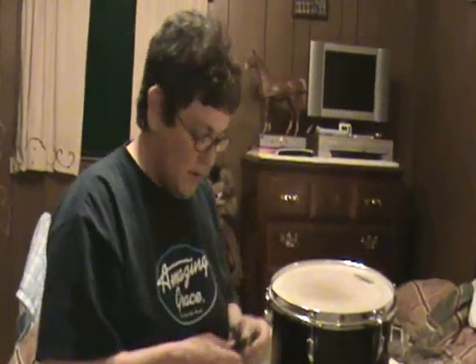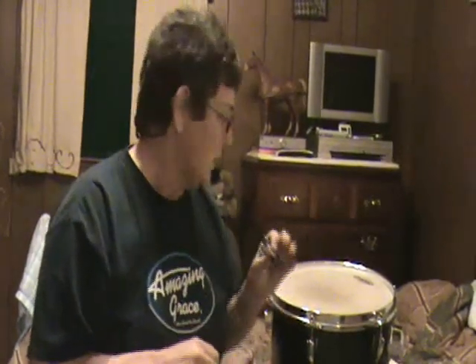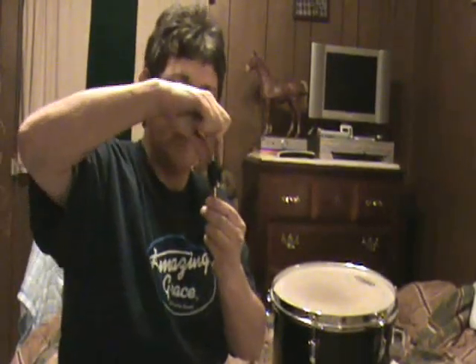The goal is — on this gauge, it's right about six with the resistance — and we're going to start with a half a turn. If you're not sure what a half a turn is, use this gauge as a reference: turn it around to the opposite side, that's a half a turn. When I refer to quarter turns, put the gauge at the 12 o'clock position. Imagine you're looking at a clock — 12 o'clock is this position, 3 o'clock is over here. Turning from 12 o'clock to 3 o'clock would be a quarter turn.